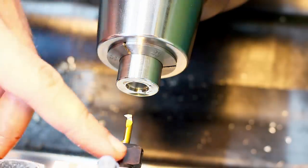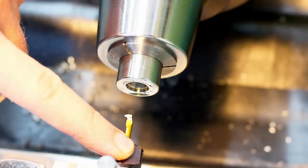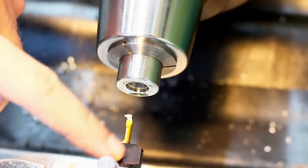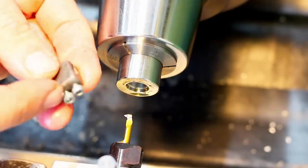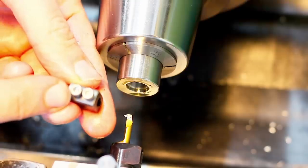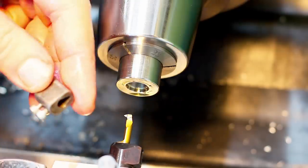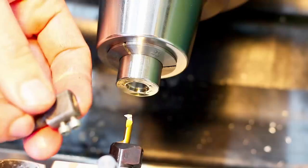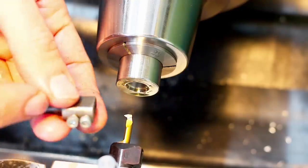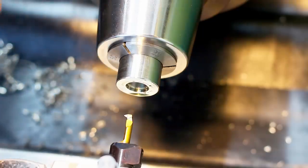I didn't know that Horn uses a very large, I think it's an M6 fine thread set screw. I went for two M3 screws, and I'm using regular cap screws because these have a full-sized hex and these can be tightened properly. M3 set screw has a tiny hex and, well, they strip all the time.